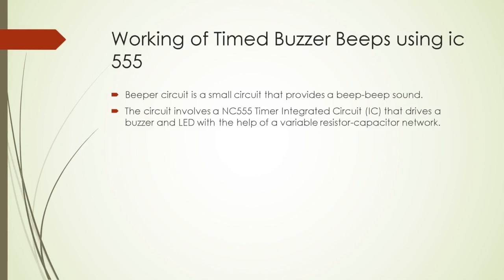The circuit works with a 9–12V battery and a NE555 timer IC. Power is supplied through the VCC pin of the IC. Capacitors are connected at the trigger and threshold pins of the IC, which are pin number 2 and pin number 6. The on and off speed of the buzzer can be controlled through variable resistors used in the circuit. The output is at pin 3 of the IC, which further goes through capacitors, and finally the buzzer sound comes through a speaker.